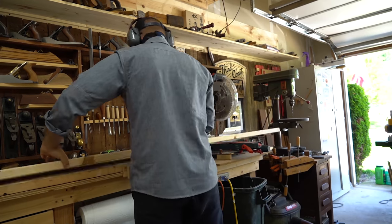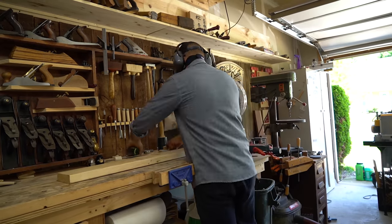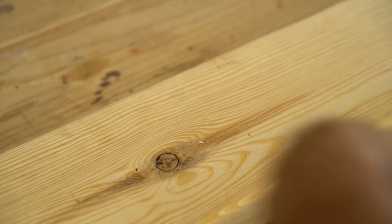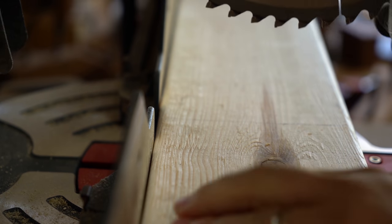All right, first I'm gonna cut up some 2x6s to make this Strongback. I'm gonna use the Strongback style that's recommended in the Spirit International plans, but I'm gonna go back later on and reinforce them some because this method of screwing one board into the side of the other board on its long edge is just not strong enough for me.